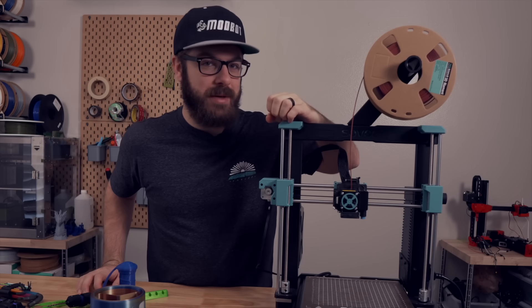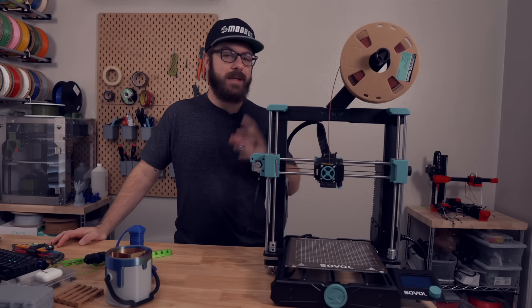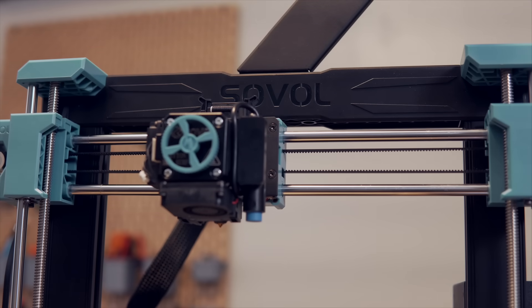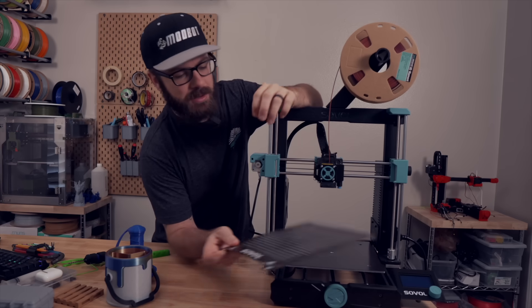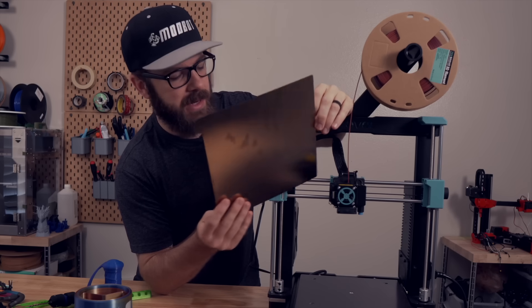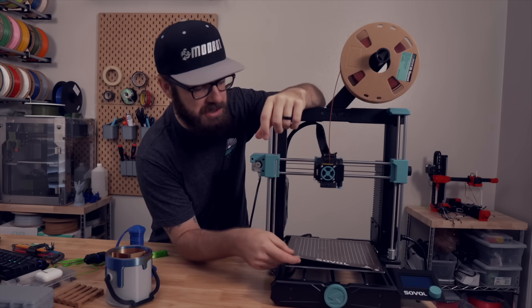The SV06 started off as a pretty frustrating experience. I'll give the Sovol team credit — although I was the one who ultimately figured out the issue, they did try their best, so I'll give them an A for effort. Since resolving the initial problem, the SV06 has been running completely flawlessly and there isn't a whole lot I'd want to upgrade. The main things: the tramming sequence could be faster and longer to better align the gantry; and the grid paint on the powder coated PEI bed is completely unnecessary — it doesn't serve a functional purpose and the fact that PETG pulls it off is unfortunate. I'd recommend Sovol just scrap the grid idea on the next batch.